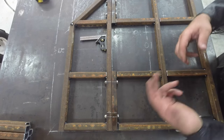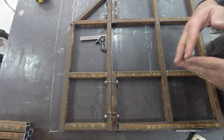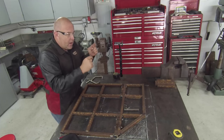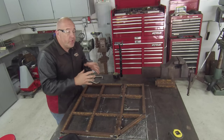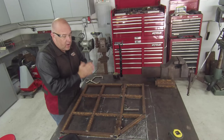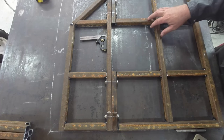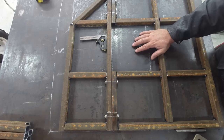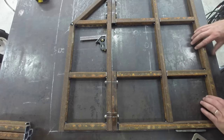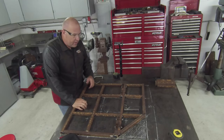So whenever you do a tack weld, sometimes you try to tack weld the side that's a little bit out the other direction so that when you tack weld it, it pulls back. Or you try to tack weld quickly on both sides or in multiple places to keep it from moving out of square. All of these are tack welded on two sides to help hold everything in place — I think that'll be plenty sufficient to move this around without fear of breaking any tack welds loose.